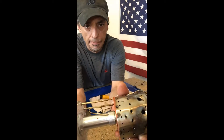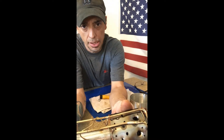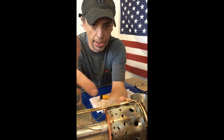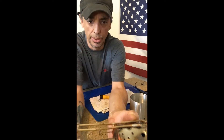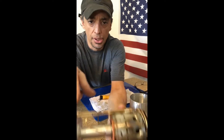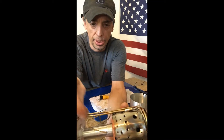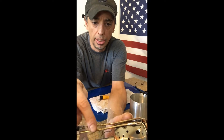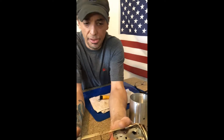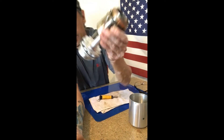Real quick, that is the oil line. It's coming off the fuel line and it's got some extra slack so as I push it together it'll create an S-bend and find its spot without getting in the way. This usually isn't that tight but what happens is you'll start creating ridges on here from bending it because I've put this on so many times, so it starts to get tight in here — which isn't a bad thing because it'll be airtight. I'll get it off in a second.